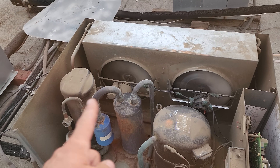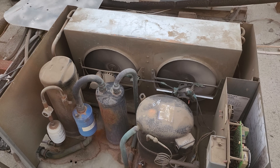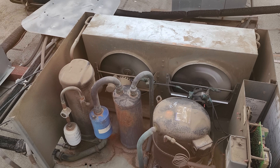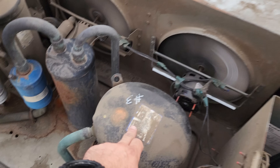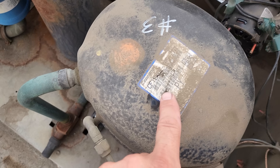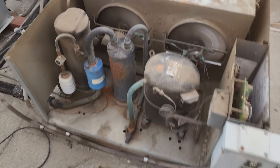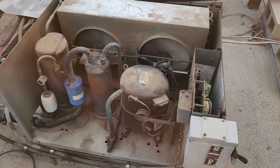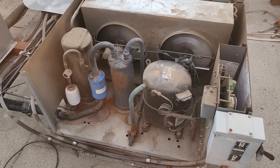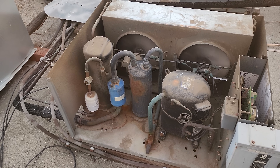We'll have to test current on those motors too. These high-pressure controls — when it gets to 110, 115 degrees, especially when they're old — this equipment was manufactured in 2007. The pressure controls tend to drift and they're not as accurate anymore, so we do tend to see some nuisance trips every once in a while.